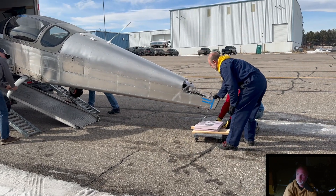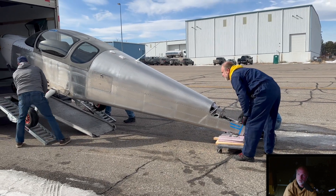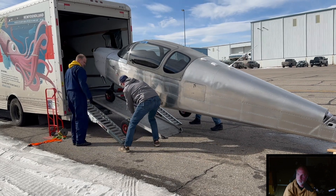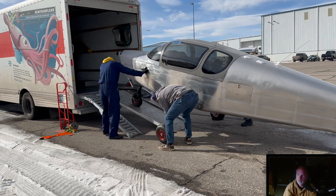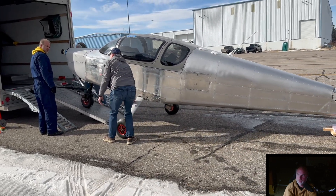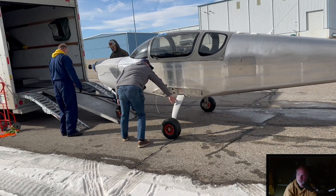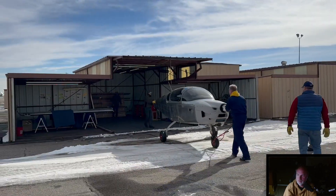The part in the back is because the rear portion of the tail will strike the ground long before the airplane is actually down off the ramp. By putting some foam blocks on a skateboard, it allows the tail not to drag on the ground as part of that process. Because the nose wheel is high, having extra hands to guide the wheels down so they can get back in contact with the ground is where those extra hands come into play. Then you just let the tension out on the strap, which wraps around the main nose gear itself.